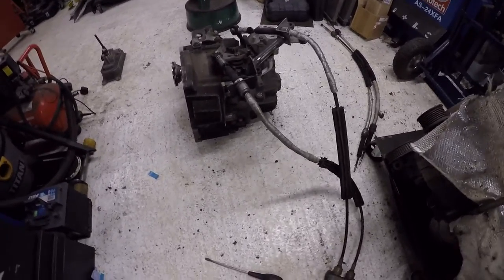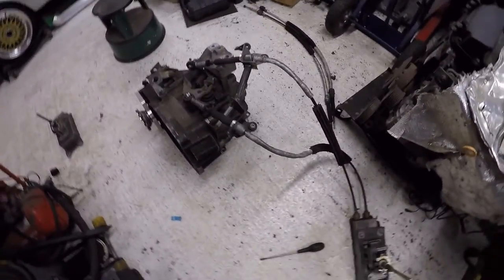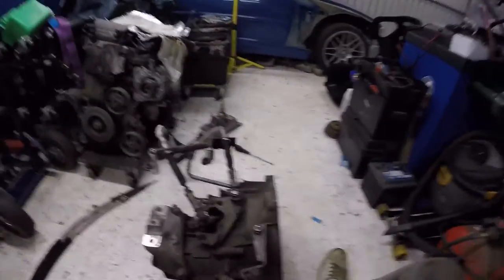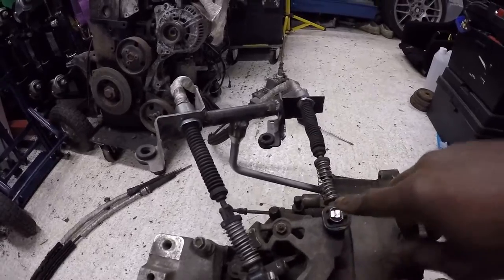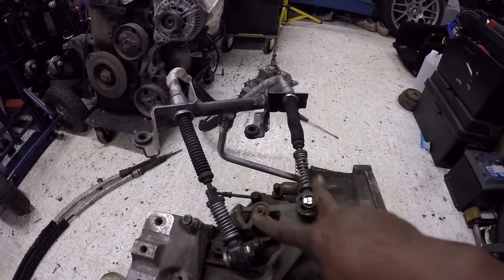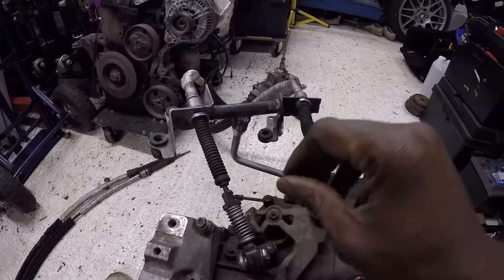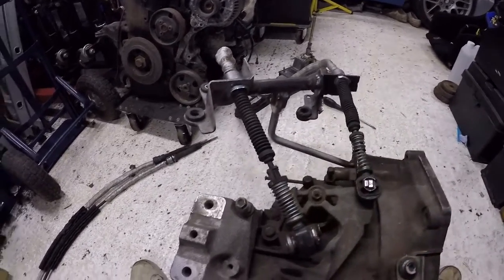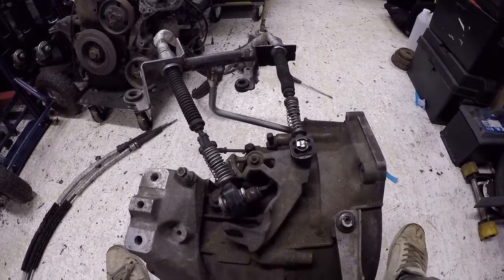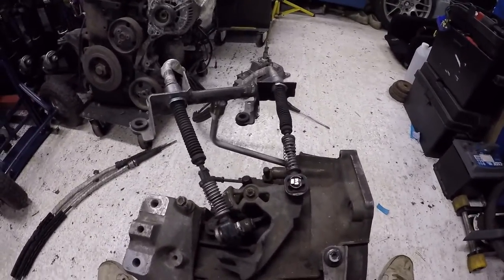That's going through all six gears — back to neutral. It feels a little bit stiff, so I've clearly got some tweaking to do in terms of orientation. But it is shifting, so I'm happy with its position. I'll be using better cables on both the front and rear — some kind of low-resistance cable — which should improve things. I'll also be cutting off this weight here to aid in shifting.